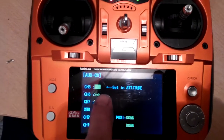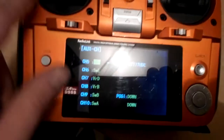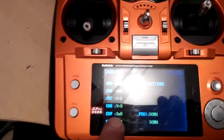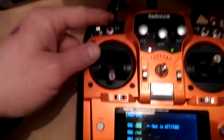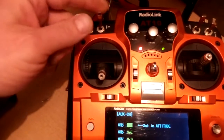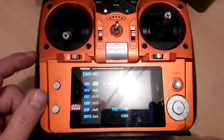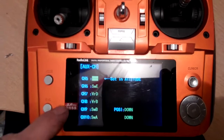For auxiliary channels, channel 5 is set to attitude mode. Channel 9 on my receiver, switch B, is linked to channel 7 on the APM — this gives me my auto-tune. So if I'm flying the hex and I want to tune it on a calm day, I flick that switch and it'll self-tune. I can then save it. Everyone's auxiliary setup will be different, but channel 5 is the important one.